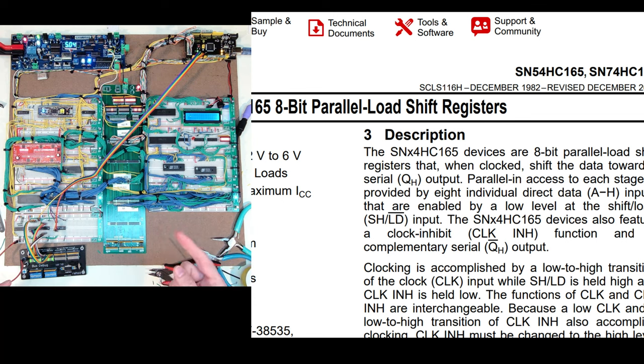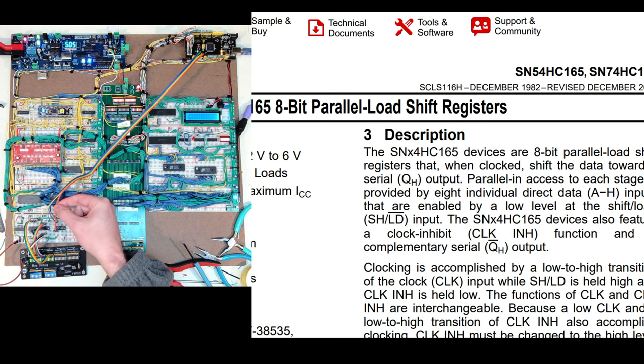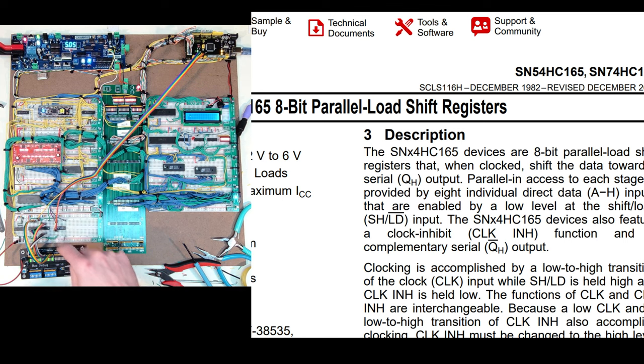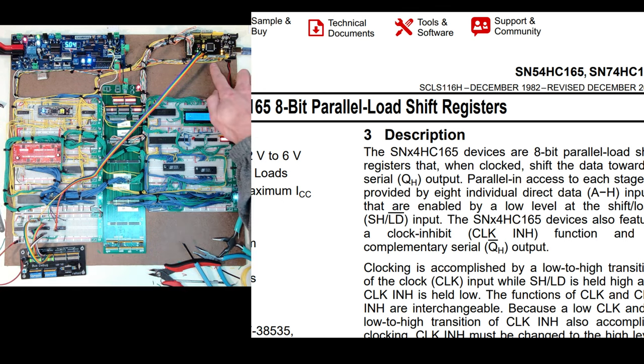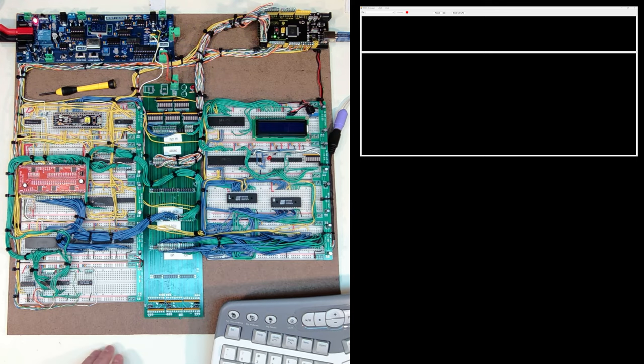I'm going to pause now to finish the connections. Instead of pulling off my temporary debug card, I'm going to bring the 16 data lines directly off the math coprocessor since everything is nice and close there. I'll pull out the temporary six lines and run some control wires, probably into a soldered connector that clicks into place. I'll be back momentarily with those updates.